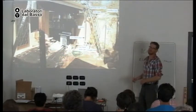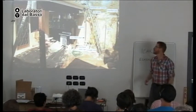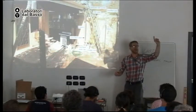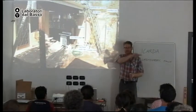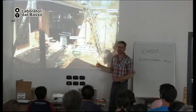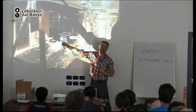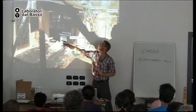But sometimes I want to move cistern water a long distance from maybe one roof to a tank 100 meters away. So I could do that overhead in an aqueduct, or if I am in a warm climate, I can send the pipe down underground and then back up and into the tank. So I am collecting water from the other house. And the other house, its gutter, is at a higher elevation than this gutter. So the whole pipe fills with water and then overflows here.